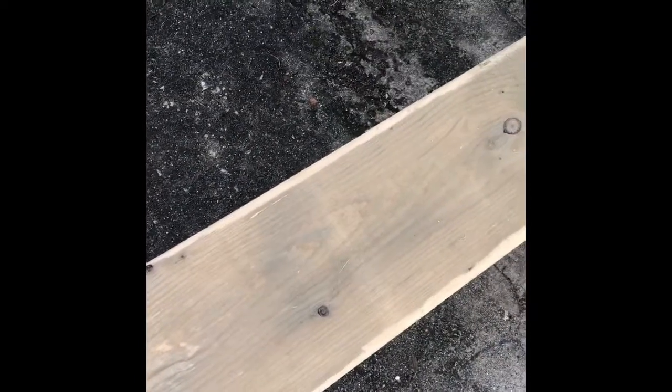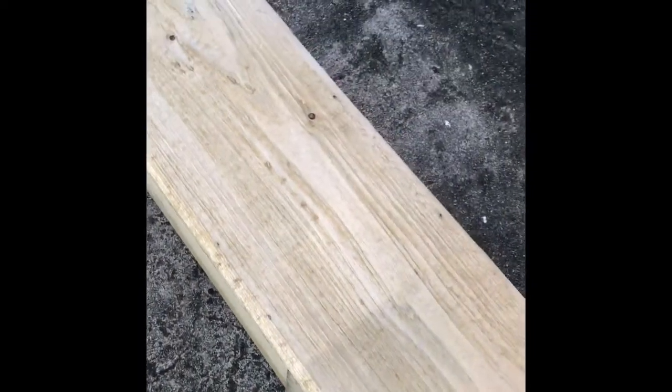On the piece I did this morning, it hasn't aged as much because the overnight piece had more time. On video the edges might look similar, but in person it's a huge difference. So my tip is: give your wood some hours of air exposure before applying the product.